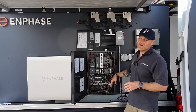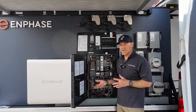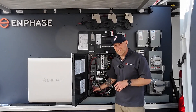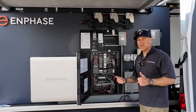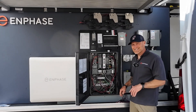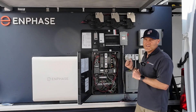This is all not live — there are no conductors on, so I can demo exactly what I want to show you today. While waiting for the utility to install the meter collar, I'd have my IQ meter collar hanging in a bag. I'm going to utilize the existing space inside the combiner's consumption CT port and use Enphase branded consumption CTs to monitor consumption, so I can use the battery and PV for self-consumption while I wait.